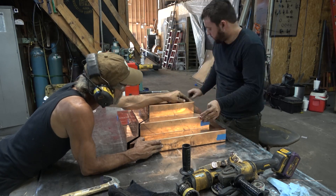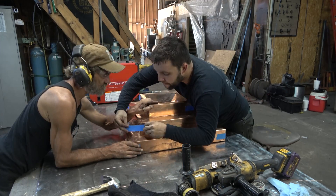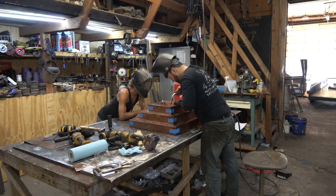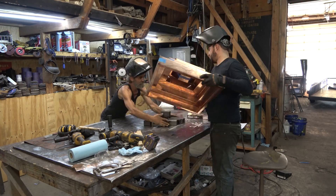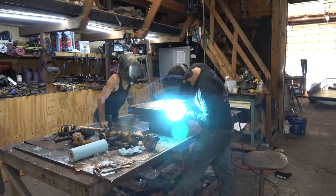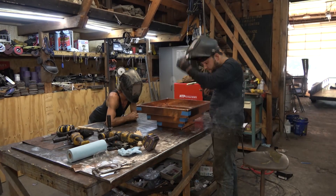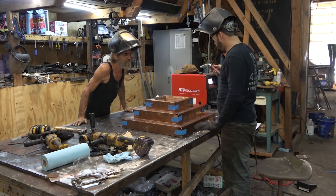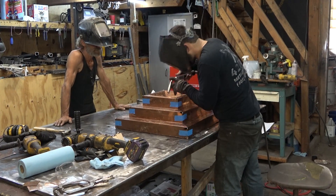This was a really well-laid-out cut. I was a little nervous because there's some room for error with the bending, but I wasn't off by more than about a sixteenth of an inch anywhere, and I could flex everything back into place — the tape held it. The whole idea was to put it together on the table, get a couple tacks on it, flip it over, and get a bunch of tacks on the backside to lock it together, then go to working on the show face. This was a new thing for me — I got asked if I could weld something out of copper, said yeah, knew the machine had the capabilities, put the time in, and it worked out.